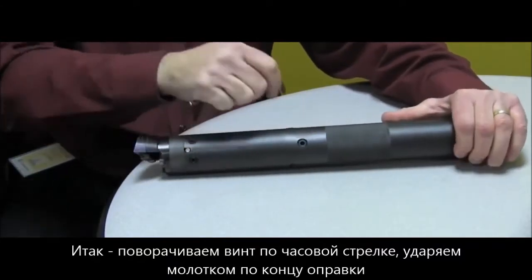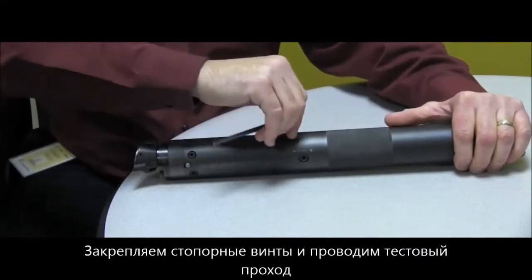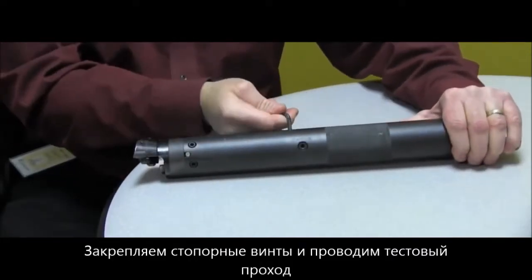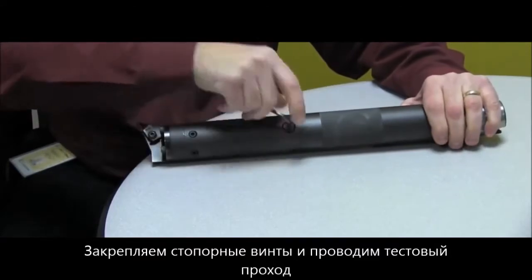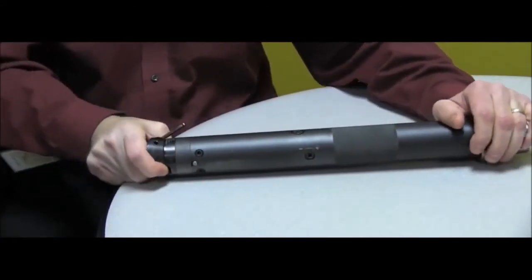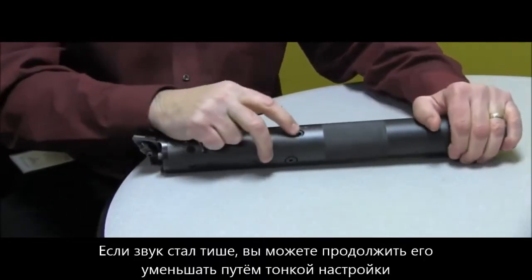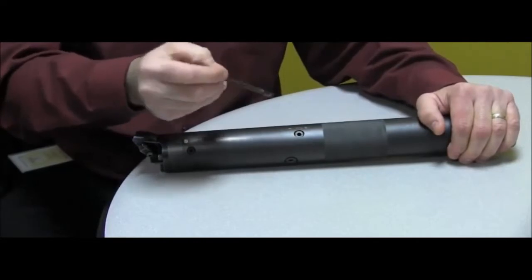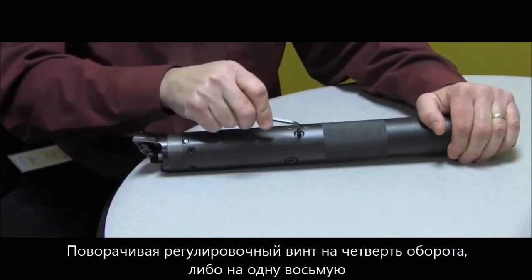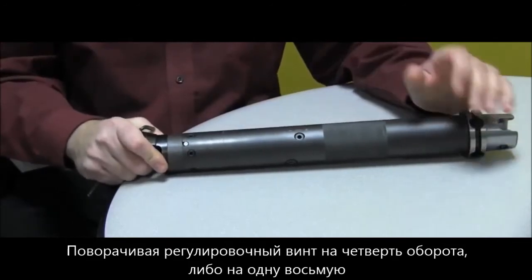After any adjustment, tap it with your hammer, lock down the two lock screws on each side, and run it again. Once the chatter starts clearing up and the noise reduces, you can fine-tune with smaller increments — if you started at a quarter turn, move down to an eighth of a turn to dial it in.